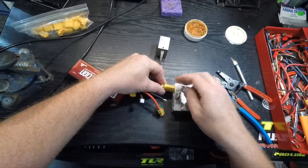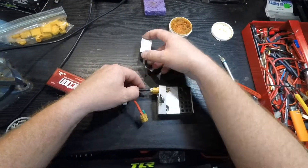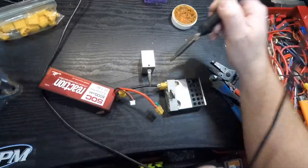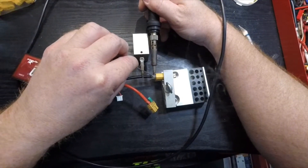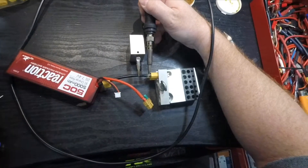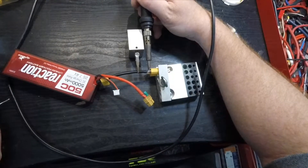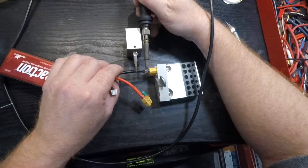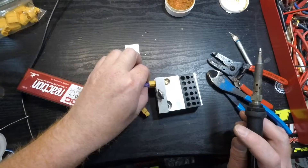All set up. I put a little more flux in there and prepped the inside. It's a pretty thick wire and a pretty thick connector, so I'm gonna get some super heat on there. You'll see the solder actually sucked down inside of the connection when it's starting to really take — and there it goes.